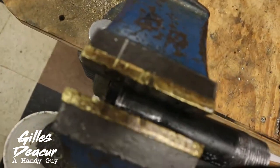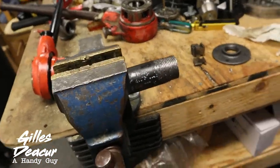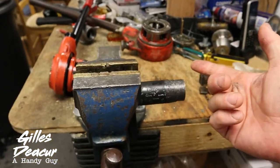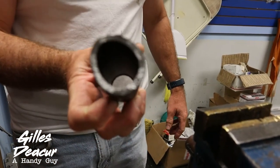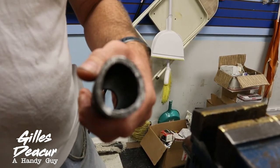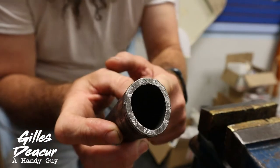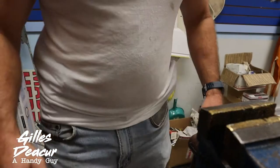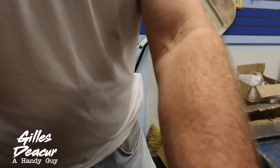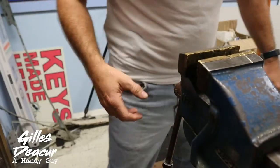In order to get any kind of grip in the vise so it doesn't spin, I had to really crank it. I found that when I'm threading it, it just spins, so I've got to crank it tighter until it stops spinning. And then to my disappointment, when I took the pipe out, we ended up with a messed-up, oblong piece of pipe. So I went to Zoro and ordered all the short ones pre-cut, which is going to save a lot of time and frustration. Let's demonstrate the use of the $111 tool versus the $33 tool.